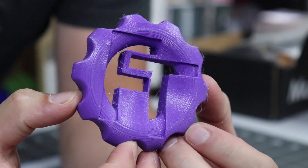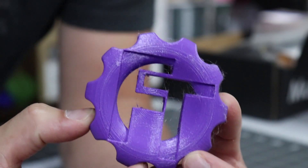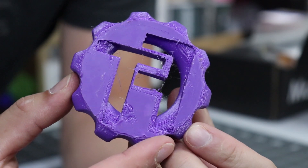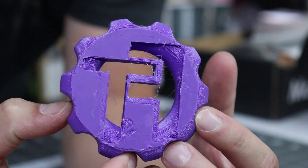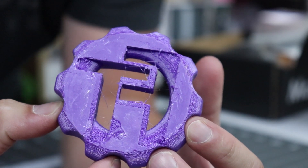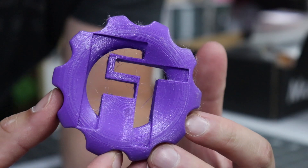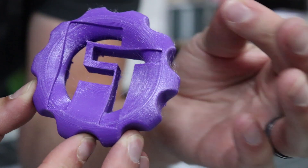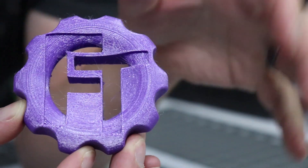Here I have a purple PETG from Amazon Basics — I've done a review on Amazon Basics PETG and it prints just fine. This one did suffer the same fate as the red from the Easy Box on my i3 MK3 clone, and it shifted kind of badly. I didn't realize I'd set it to print and walked away. It's 100% the printer's fault, and sadly I don't have enough to reprint. It is a little bit stringy, which happens with PETG if you don't have things precisely dialed in — easy to clean up with a blow dryer or heat gun.